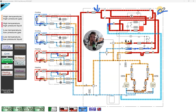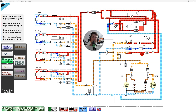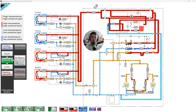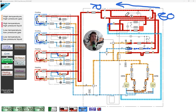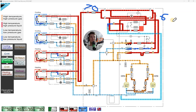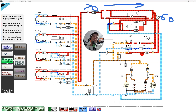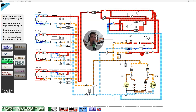We have two key sensors: the liquid receiver inlet temp, leaving our combined liquid, and the subcooled heat exchanger liquid temp. These two sensors tell us which direction the liquid is flowing. If this side reads 70° and the other reads 80°, it's flowing toward the indoor units. If this side is 70° and the other is 60°, the liquid is coming from the indoor units to the outdoor unit. We're measuring the temperature differential between these two sensors to determine the direction of liquid refrigerant in parallel operation.